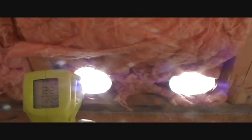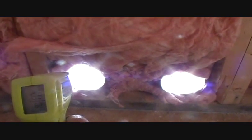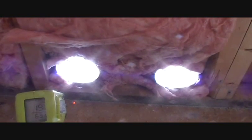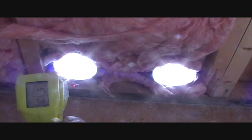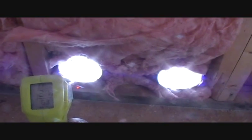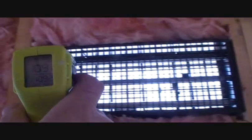The air temperature going in — if you're looking at the air actually inside the bottom of the box, it's 62 at the bottom of the box, which is pretty cool. But if you look right here at the floor, the floor is reading 19.4 degrees Fahrenheit. So we can roughly say the incoming air is around 20 degrees. And the outgoing air is 109, 113, 109. Not a lot of flow, so I'm hoping with a couple of fans that will be improved.